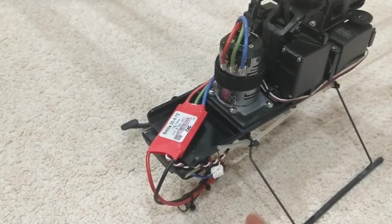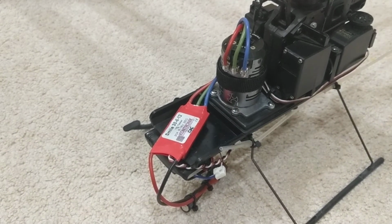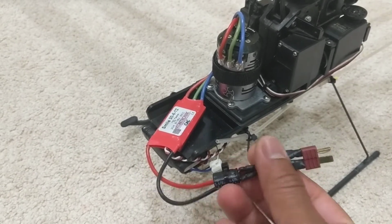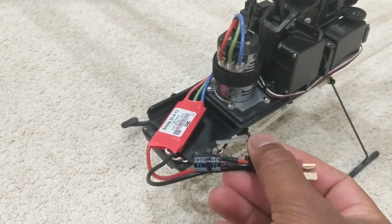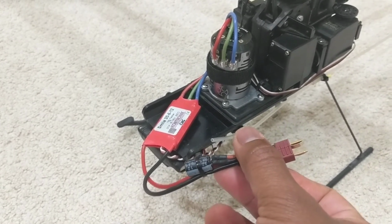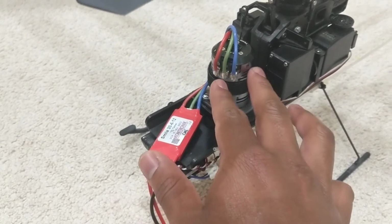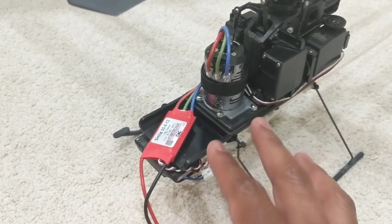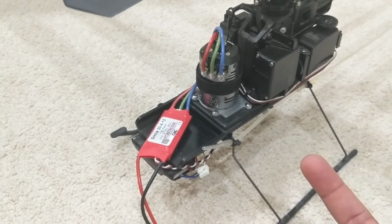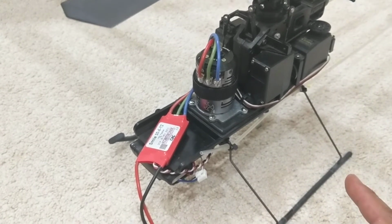Definitely, first of all, something's up whenever you don't even have a capacitor on a brushless speed control. Always question that. That ain't right, especially for something like this. So I added one. If you see a speed control for a high power application that does not have a capacitor, there's something going on, guys. This has a very difficult time starting this motor. I can't even use governor mode. It does weird, crazy things that really jolt the gearbox. Eventually it starts to work, but I just don't want to damage this thing. So I run it in airplane mode. I can work through the funk. But anyways,